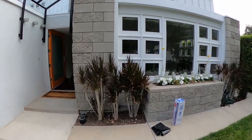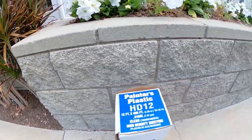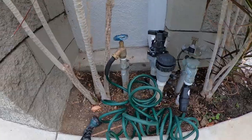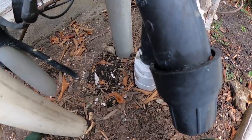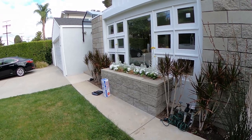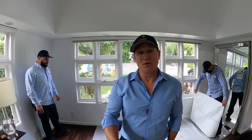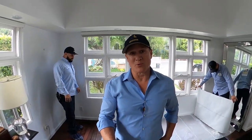This is the home and this is the room that's affected. We've got a sewer planter bed here that comes all the way across this way. We do have a small leak at the PVC line here, but the general home inspector is what discovered the wet wall in front. Before Marco was called out, we had our mold inspector Alex come out and do an air test. He detected the moisture, performed air samples, and it came back with high elevation of mold. This is what led us to come out here and figure out what's causing the mold.